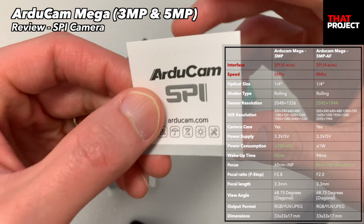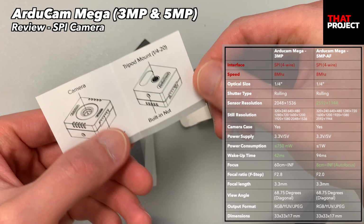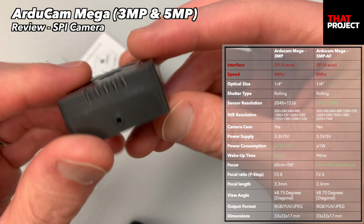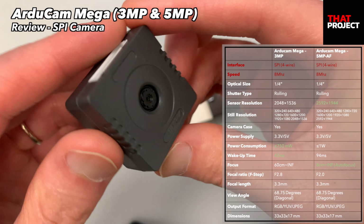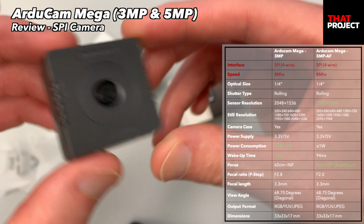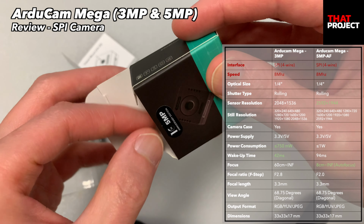It seems to have adapted the SPI interface to make it work with almost any microcontroller. It means not only Arduino but also STM32, ESP32s, and Raspberry Pi can be used by connecting via SPI. That's awesome because it's possible to acquire images from the camera through only 4 SPI pin connections. So the module of this camera can be used in a variety of hardware. The advantage of this is huge.